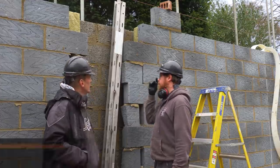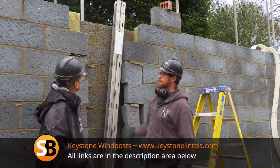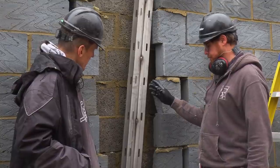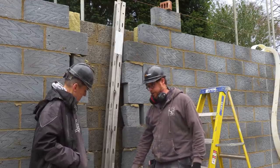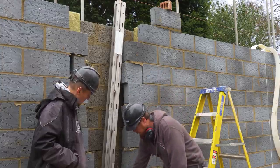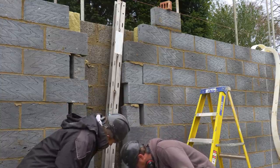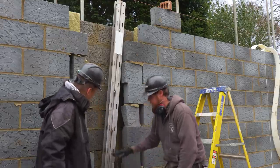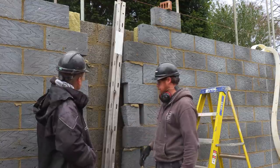So where did this come from? This came from Keystone Lintels — nice little sticker there. They make them to measure — you can't buy them off the shelf. You have to get all your measurements in place first: we need to know the height of our slab, then from the slab the height of the first brick course, and they go 225mm all the way up for every course. There's a bit of slot there so we've got some play if it's a bit up or down.